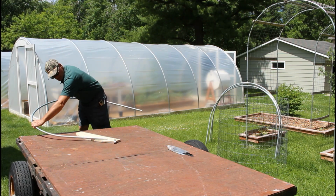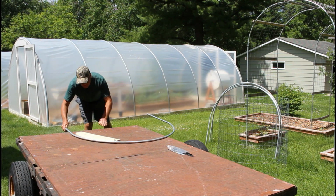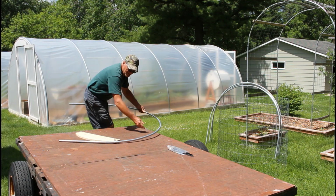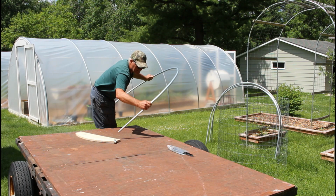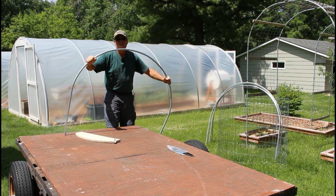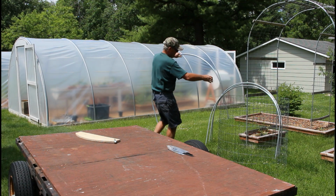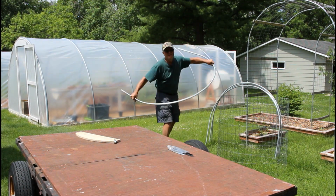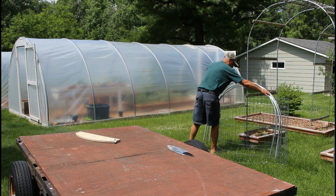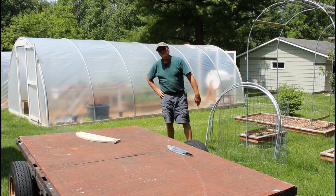And then, since you need to do it on this side of the bender only, I'll reverse the hoop, push it through, and then I'll do the same to the other side. Just tweak it past just a bit. And that'll help give it vertical legs. So we're gonna add legs to these. Now these hoops, they're not all identical, so you can just push them and pull them and configure them so that they pretty much all match. But now we have 4. And I can see right now, this one, I probably got a little overzealous with my bending at the ends, but good enough.